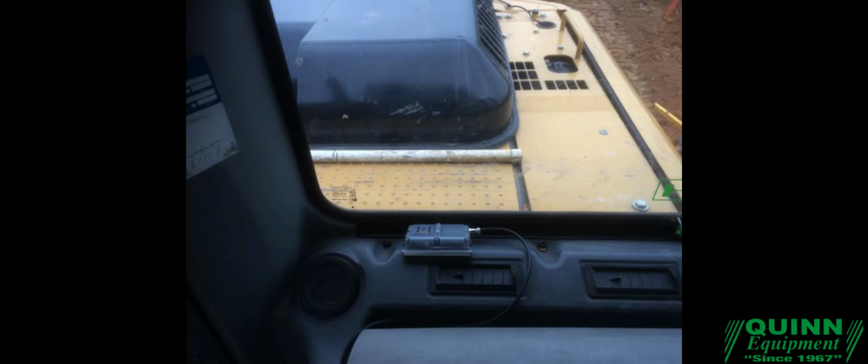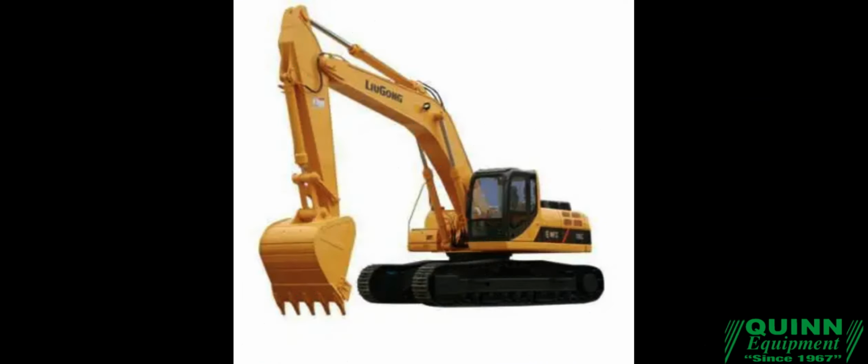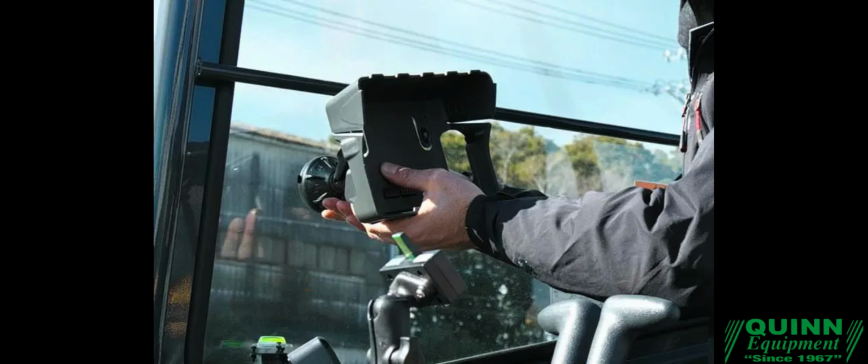The sensor ideally needs to be placed in a spot that is level to the floor of the cab. Installing the 2D sensor on a tilt is acceptable if a level location is unable to be found. A maximum angle of 30 degrees on both axes is okay. Is free from vibration. Avoid plastic molding that is removable, as this can vibrate when the machine is running. Has adequate space for cable and plug.